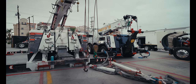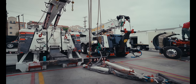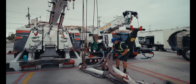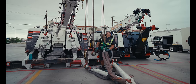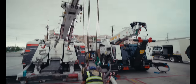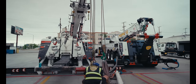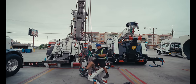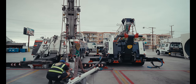Re-rig complete. I do not like overloading my equipment, so this is going to be a super clean lift with absolutely no piece of equipment overloaded. The spreader bars are ready. This is called continuous rigging - I four-parted the lines on the heavy side. So line-wise, it's going to be four lines to the front end: 16, 32, 48, 64,000 pounds of safe lifting capacity. Plus two snatch blocks at 60,000 pounds - all the rigging is way more than accounted for.